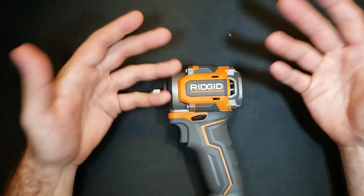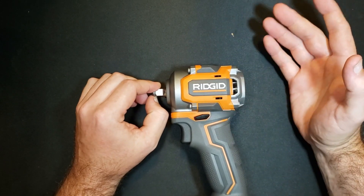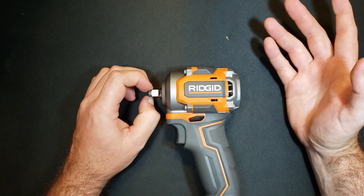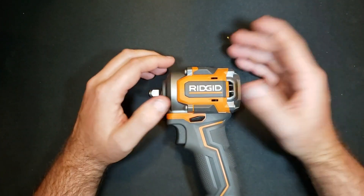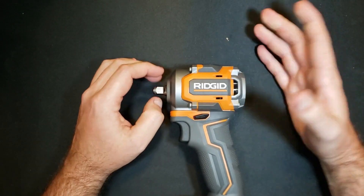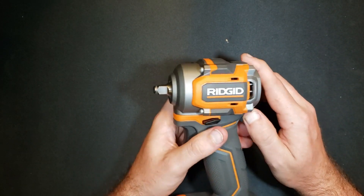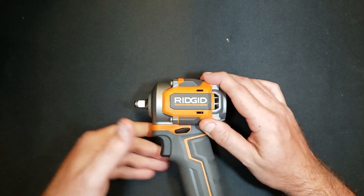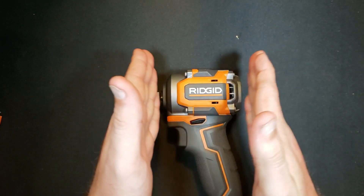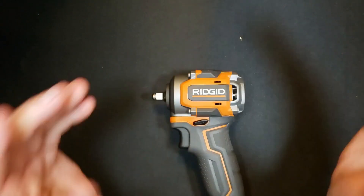There is something to say about longevity. With a brushless motor, they do last longer because they don't have as many moving parts to wear out — they don't have brushes, only ball bearings at either end. But normally you never reach the end of life of a brushed motor anyway, so that's probably not really going to be a factor. The main reason to go to a brushless system is to squeeze your power density down into a smaller package.